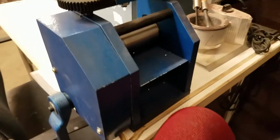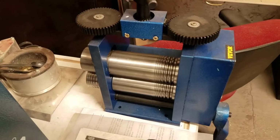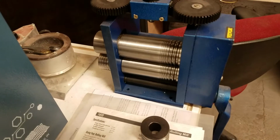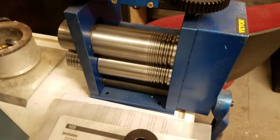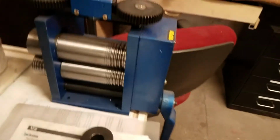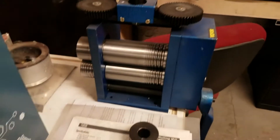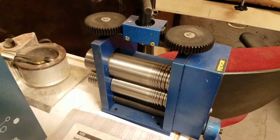Over here at the rolling mill, when you're using it, make sure not to use ferrous metals, which at this point should go without saying. If you are using a ferrous stamp, like a steel stamp to make an impression into your softer piece of metal, you need to make sure to sandwich that piece of metal with copper plates to protect the rollers from getting dinged up by those impression plates. And sometimes these rollers might get crooked, or you might want to exchange the rollers on the sides. Before making adjustments like that to the rolling mill, please make sure to talk with a facilitator.